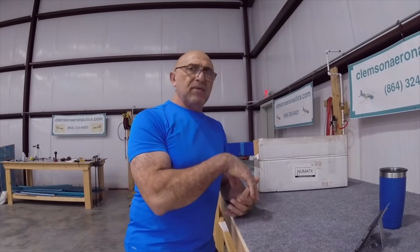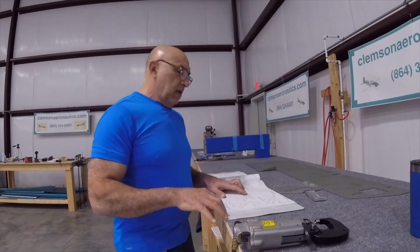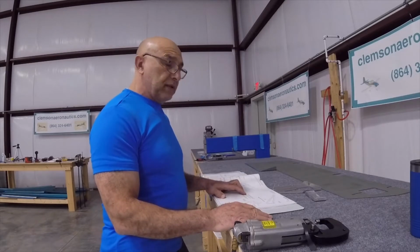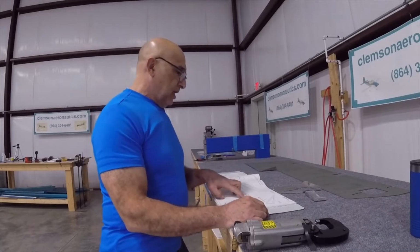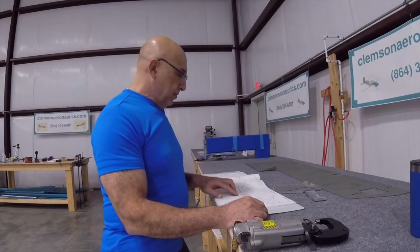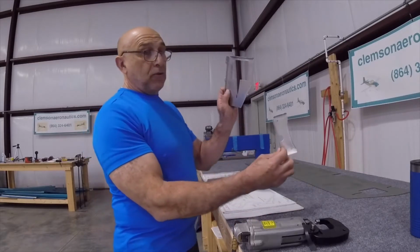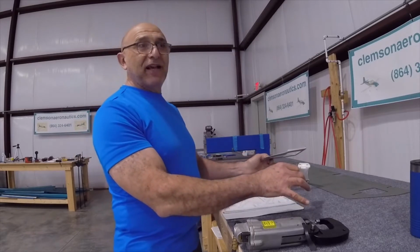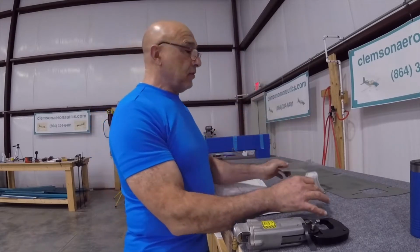I read just a little bit, and there are a few explanations about what we're about to do. Now, page 0911, bottom right corner, talking about E1410 trim access reinforcement doubler and E1411 reinforcement doubler brace. These 2 parts. I brought them in, I cleaned up my table, and I brought in the bottom skin of my left elevator on the right side, and with these 2 pieces here, we can work on those.